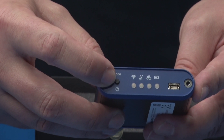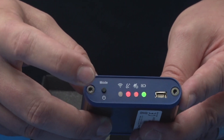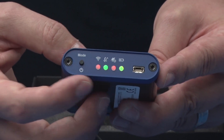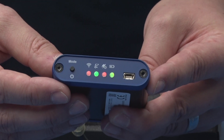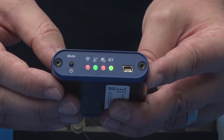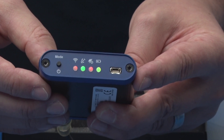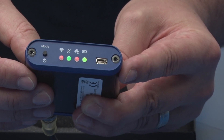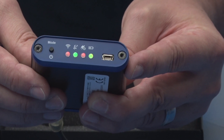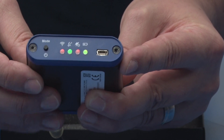Opposite, you see the switch-on button for the Sense Control Wireless Master. Here, the LEDs light up after power on. The first LED indicates wireless communication being present, respectively smartphone or tablet connection to Sense Control wireless IO-Link Master. Here, no connection is present, so the LED is red.